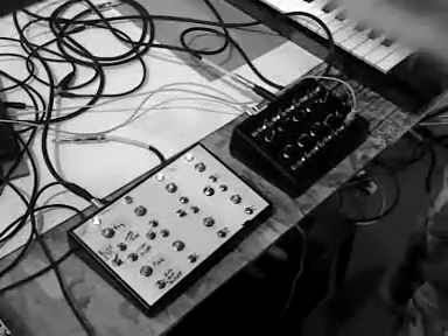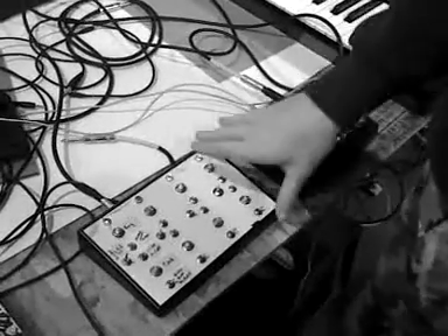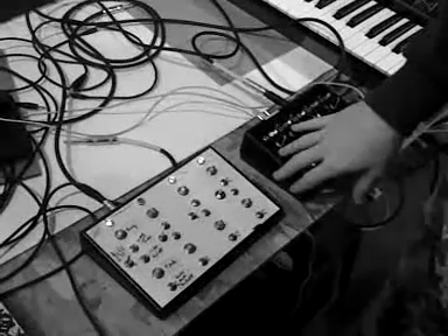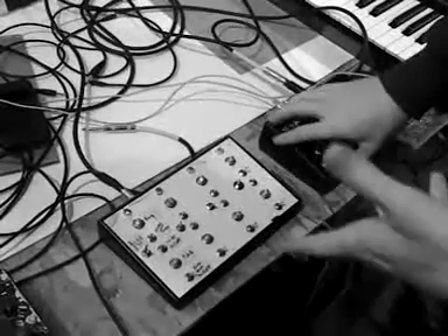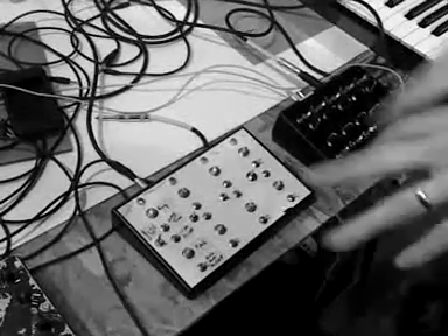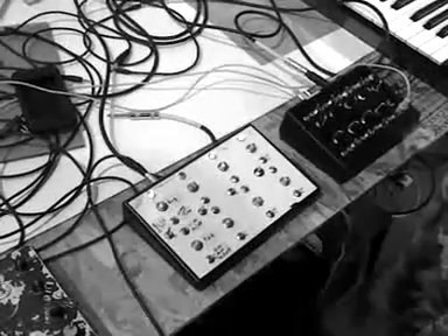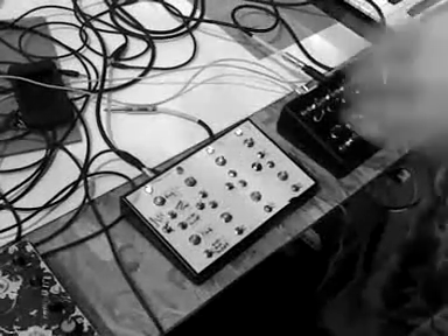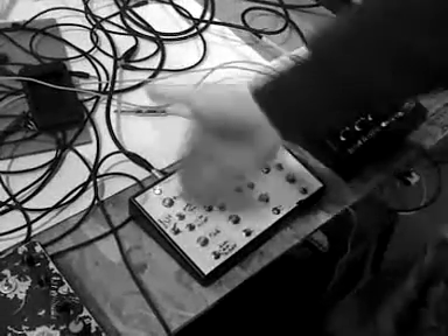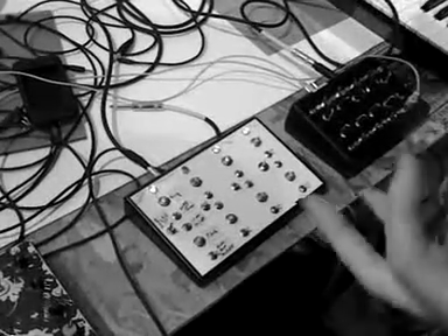That's monstrous in its effects. I've got two things I'm going to be showing you. Right now I've got the NAND drone synth just by itself, not connected to a sequencer. I'm going to show you what it does when it gets connected to a sequencer, but right now I'm just going to show you these functions. It's a 4093 chip, a NAND gate chip that is being controlled by four different 555 oscillators that basically merge together to mess around with the sound.